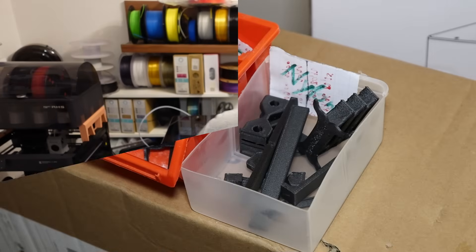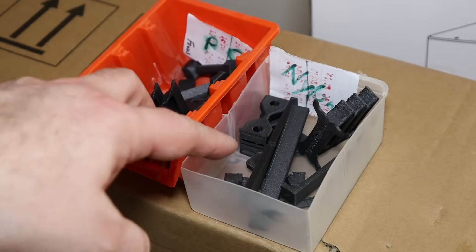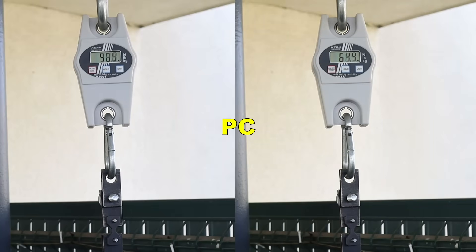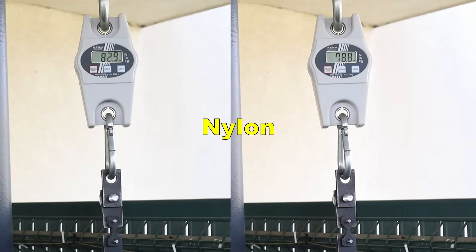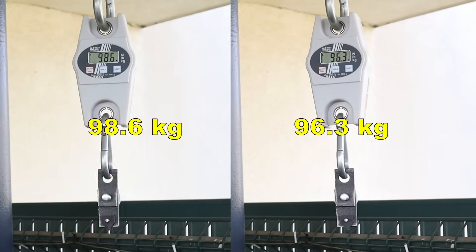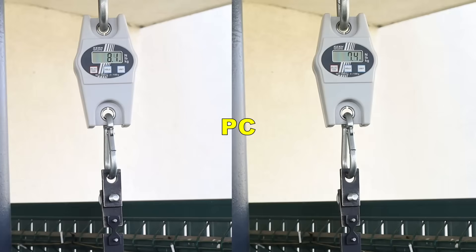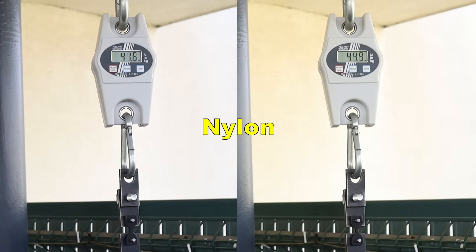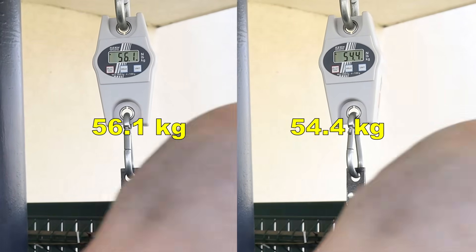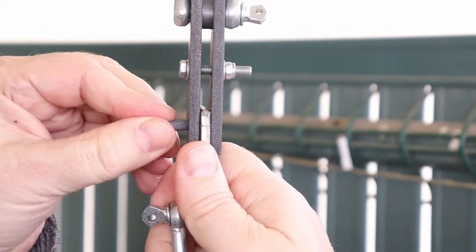After 10 days at room temperature and 50% relative humidity, the Nylon absorbed some moisture from the air and is closer to the stable state — now I can start mechanical testing. The tensile test with horizontally printed objects: this kind of irregular surface is always a sign of strong materials. And now the layer adhesion test with vertically printed objects. I was worrying that carbon fibers would make this material weaker, but in both cases there is great layer adhesion.